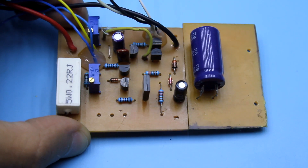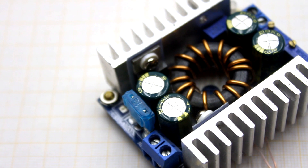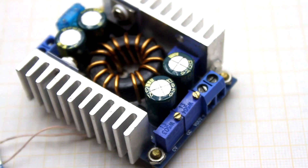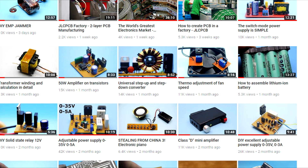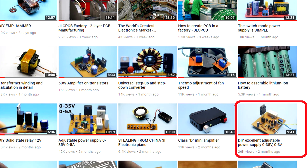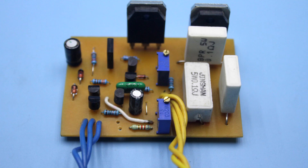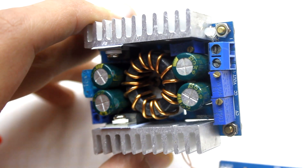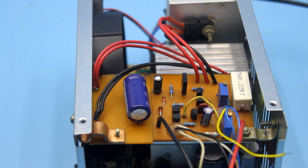The rectifier board with the capacitor is attached to the stabilizer board, which will allow adjusting the voltage and current from pure zero. You can buy a ready-made voltage and current stabilizer board for 5A or more — they are available at online stores and cost cheap. But I preferred to use a linear stabilizer which I made in one of my previous videos. There were two videos about the stabilizer on my channel: in one we assembled a classical circuit with a current of 3A, and in the second I increased the output current to 5A. It's up to you to choose any version; the links to both videos will be in the description. I put the 3A version since I'm building this power supply only to show you the method, and I leave the 5A board for another case.